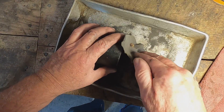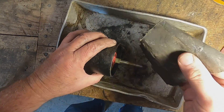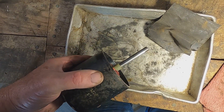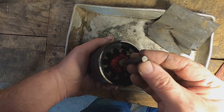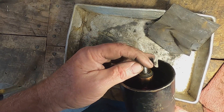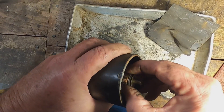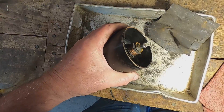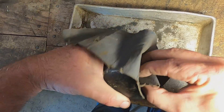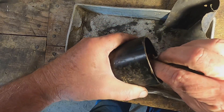Here's some emery cloth — we'll just try to polish this up some. To finish it off a little better, I put it on the wire wheel over there. Polish this tip up that sticks in the end — that's nice and smooth. I didn't want to hit the end right here. And then we'll touch this commutator here very gently with this emery cloth. Oh yeah, in that little bit it feels better. Let's do this end here — okay, now we've got another squirt of the cleaner, clean that off.